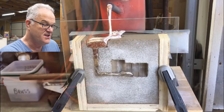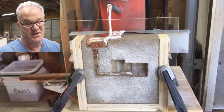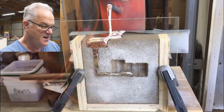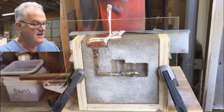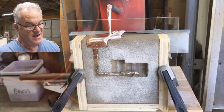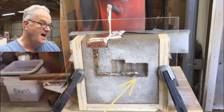Here's the other interesting thing to watch — I'm going to go just a couple of frames at a time. Look at this leading edge of the metal and see what it's doing. You see it's got a little bit of an upward slant to it. Watch this. Did you see the way that happened? We just did a couple of frames. It comes up and over, and right now where I've paused again, you can see it entering that last chamber, and you can see the metal has kind of leapt over the top of those ridges.